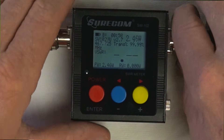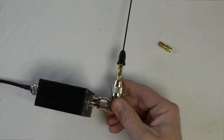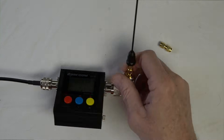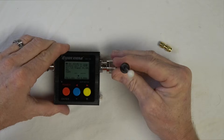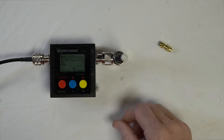Now we're going to test out the antenna SWRs. It's very difficult to do on a handheld radio — you have a lot of connections going: a connection there, your base, another connection into the SWR meter, coax leading in, another connection — so there's like five or six different connections. You're not going to get an accurate reading but you can get a really good idea. I'm going to make sure everything's snug, and we'll start on channel 22. Antennas need a ground — typically this is your ground — but on a wood table you don't really have a good ground.